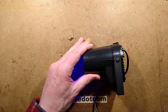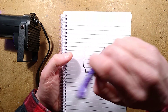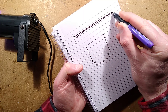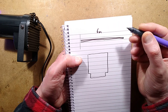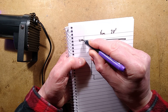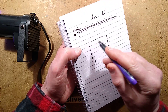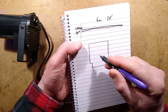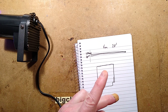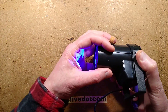This is probably, as you notice, a blue one. Let me just do you a quick doodle to give you an indication of divergence. Over a distance of six meters, which equates to about 20 feet, it diverges to 250 millimeters — which equates to 10 inches. So over a throw of 20 feet it goes to 10 inch square, which is actually really good. It is distinctly square — it's very clearly the image of the actual chip being projected. If you project it much closer, like on the bench, it does look quite round, but that's largely just the shaping of the beam as it's coming out of this sort of tunnel.